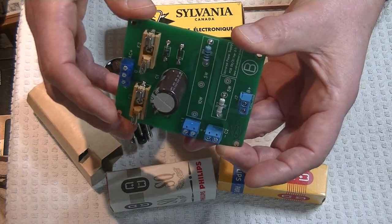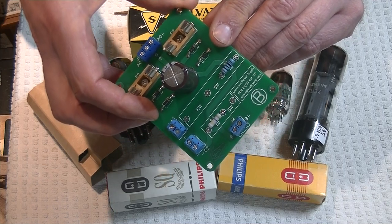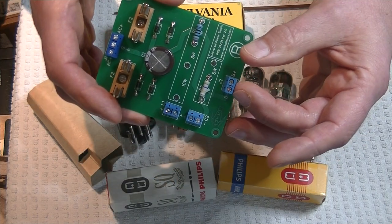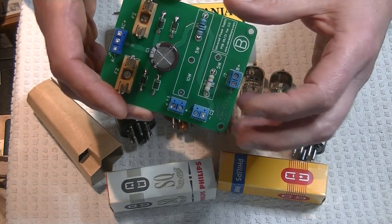There's a little filter capacitor at the input, four diodes — so that's a full bridge — and that'll give us rectification. It'll take the AC that comes in and send DC out. And then there's just a little dropping resistor and a little bleed resistor.